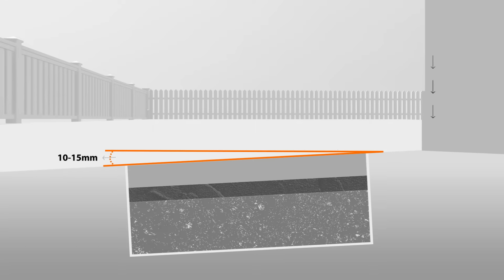Now this is a really tiny little path, it's only 800 millimetres wide. If you're going to lay a large area, say a courtyard with all your pavers, wee little tip for you, lay some pipes down the same thickness as you want your fines to be. So in my case, 30 millimetres. And then spread your fines over top like I've done here, and take in a straight edge, pull your straight edge over top of your pipe like this, and that'll leave you exactly the thickness of your pipe. Once you've spread all that out, you'd simply take your pipes out, brush in a little bit over where the pipes are, and that is exactly 30 mil thick.